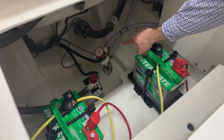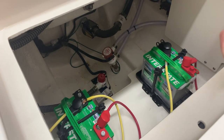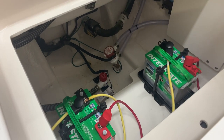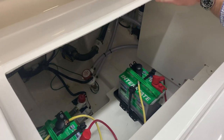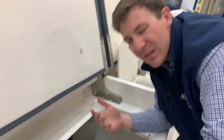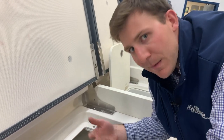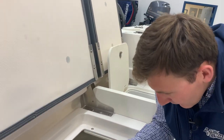Right here is your wash down through hole. On the back side of that pump you're going to see a ball valve. If the valve is perpendicular — meaning at a 90-degree angle to the hose — it's closed. The only time you'd have that closed is if there were a leak and you wanted to kill water going to it. Otherwise, most people leave it open all the time, but it's good to inspect it and make sure it's not leaking.